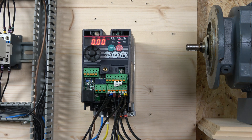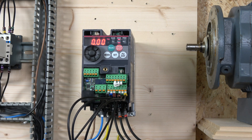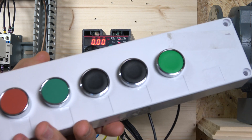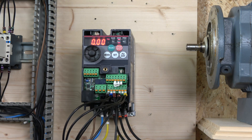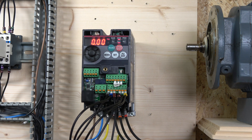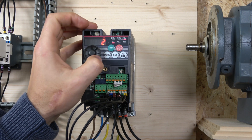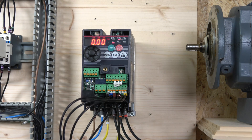Next, let's look at multi-frequency. The cables have been rearranged for this. I've removed the E-stop for demonstration purposes — you should of course use one in a real installation. To do the multi-frequency, we need to go back to parameter 59 and change it back to 0.